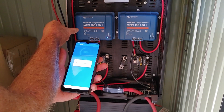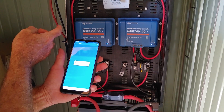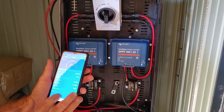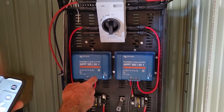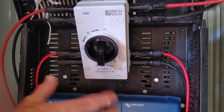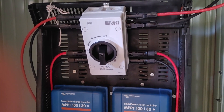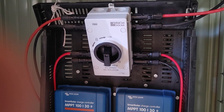Array number two is 231 watts as well, so we're running about 460 watts total on both arrays coming into the battery. This here is your PV shutoff switch — the neat thing about this is you can run two arrays into it, which is what I did. So if I have an emergency, I can just shut these switches off. And of course they're fused close to the panel, so if there's any problem the fuse will take care of it.